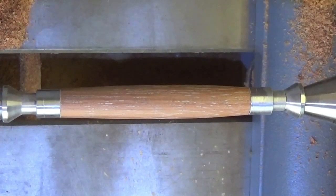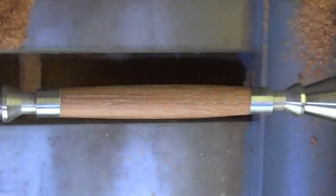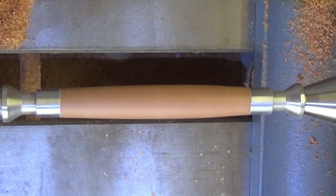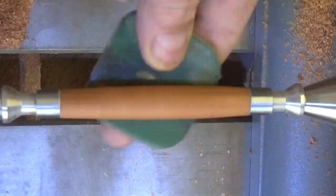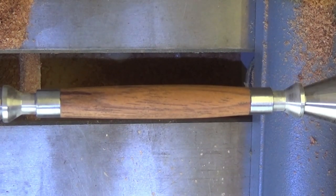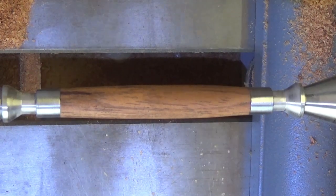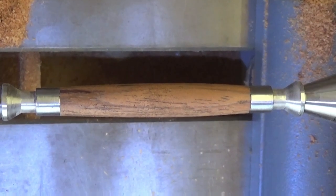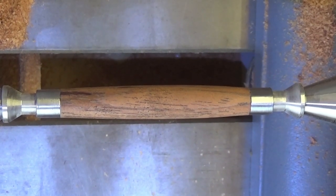Now these little pads are padded — they're the same as the micro mesh sheets that you can get, same grit, but these have got a bit of sponge on them. I tend to use these with a bit of water, just dip them in water, not too fast a speed on the lathe. Now these usually start off at 1500 — if you remember the sandpaper stopped at 1200. I've lost my 1500 so this is the 1800, but it goes all the way up to I think 12000. Quick dip in the water — if you go too fast with these you can burn into the rubberised coating.